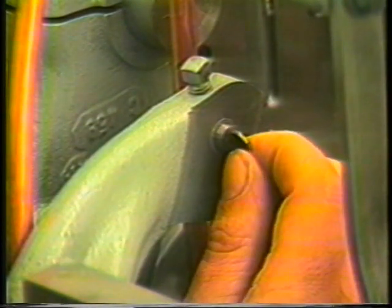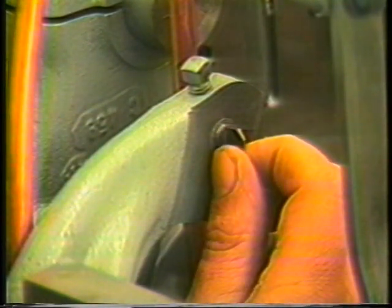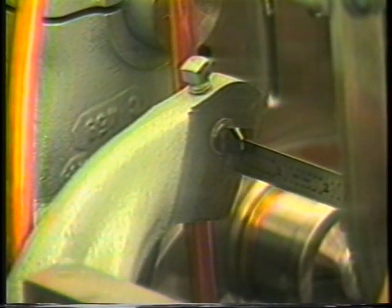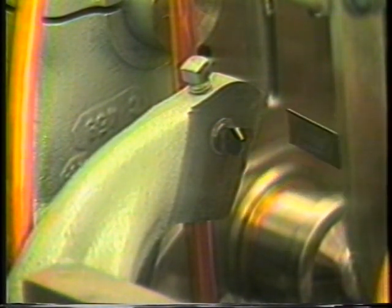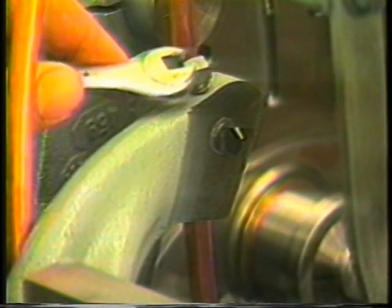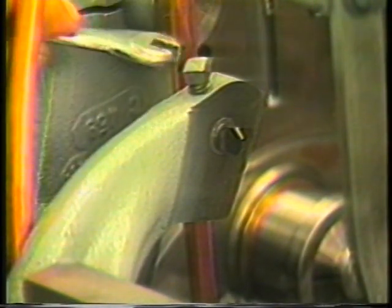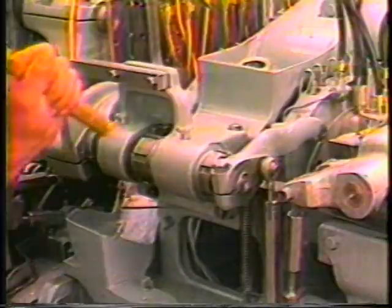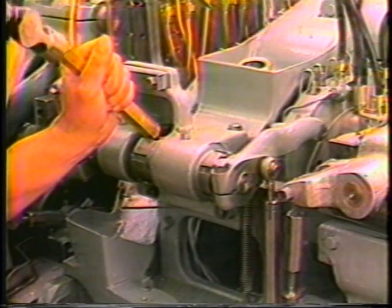Install the drill. It may also be necessary to change the drill bushing. Scale the distance on the workpiece layout. The drill should protrude from the arm — set the drill accordingly. Secure the drill in place. Approximate adjustments as to drill depth may be made at this time.